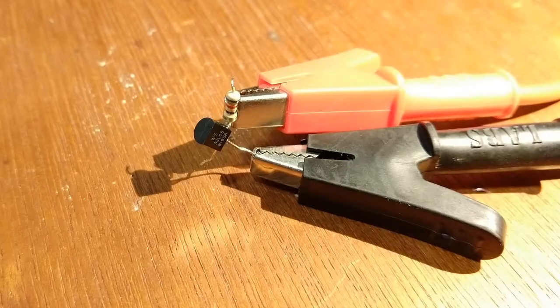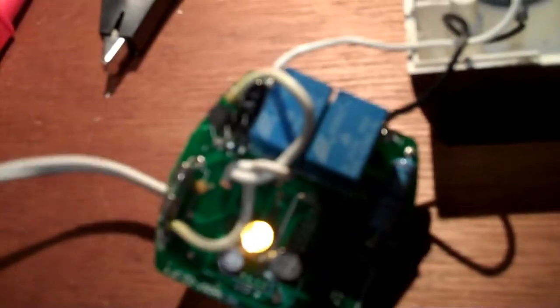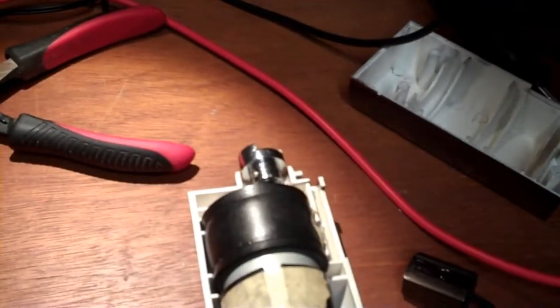Either that or the voltage was just too low. I took it out of the circuit and thought maybe the resistor was a problem, so I bypassed the resistor, but the problem was definitely with the power regulator. Luckily I had my own 78L05 in stock, so I just soldered that back in. I didn't bother putting the resistor on because according to the spec sheet it'll be just fine in this application — the power draw when idle is only 8 milliamps, so this device can easily handle that continuously. My suspicion is maybe the factory was using a batch that were counterfeit or just bad, and they knew they wouldn't go up to specs, so they put in that resistor to try to limit current through it. But all I know is that power regulator died, and when I replaced it the system worked just fine.